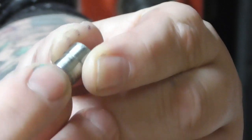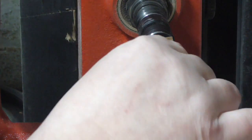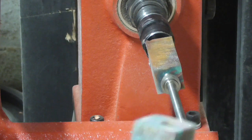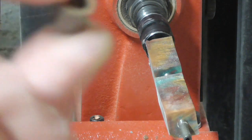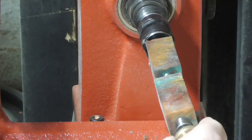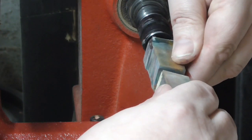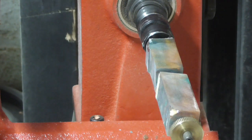which has got a piece that slides over it. You put the thickest end towards the top of the small blank, so that floating bush can float on and off. Then you get your other largest blank and place that on. And then you get another big bush for on the end where the cap goes. And then you just put them on your mandrel and tighten it up. Line the blanks up on the mandrel. Tighten it down. And then off you go.